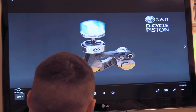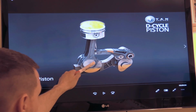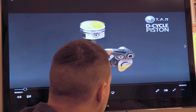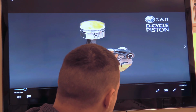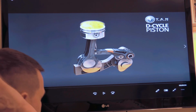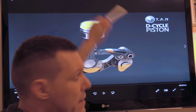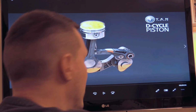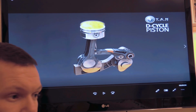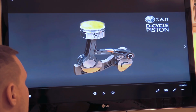So what I want to do is just pause it there. Crankshaft there, conrod, piston, wrist pin, top of a piston, this weird big arm, we've got a roller bearing there, even with an E-clip. Oh, very nice. Camshaft here, basically, it is a cam. So you call it a camshaft. And what's missing from this design is above at the top, there are 2 camshafts or a camshaft and a regular 4-stroke head design. So just an intake valve and exhaust. Regardless of the numbers, it's the same thing. I've actually looked at the patent for this as well.